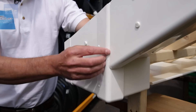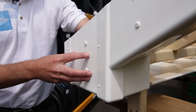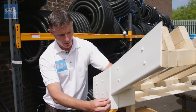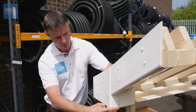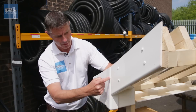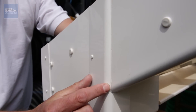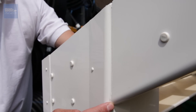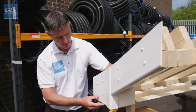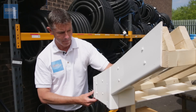We cut this one section out of the box end board. We then use a corner on the front, a corner on the back, and just cut that section of the corner out. The whole corner runs up there, then we cut this section off and essentially turn that little bit into a joiner, sealing it with silicone sealant. You probably won't need this many fixings on your box end — the person who made this model has been a bit overzealous — but it is important to get a nice firm fixing in place.